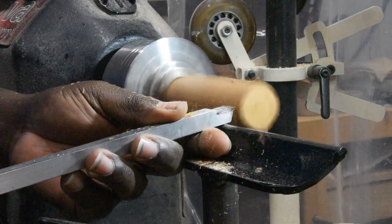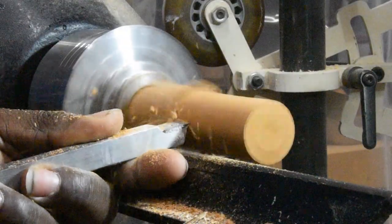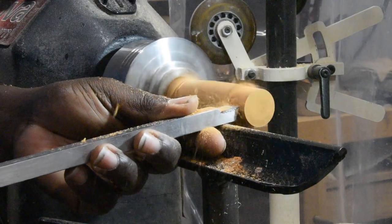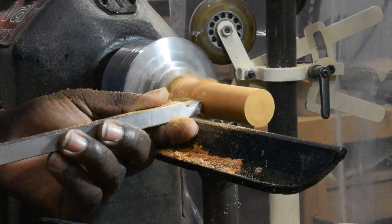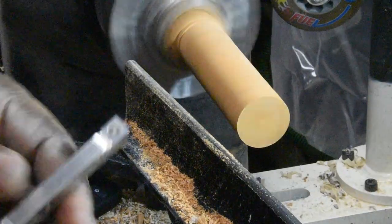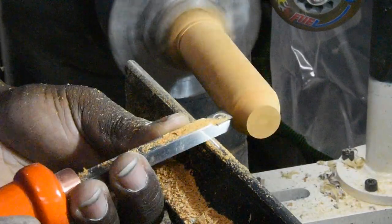As with any finial, the first order of business is to get the blank round. An EasyWood Tools rougher rounds the blank out nicely. Once round, the end is tapered to prepare for turning the fine details on the end of the finial.